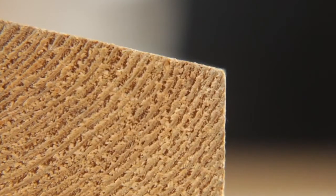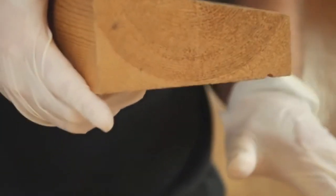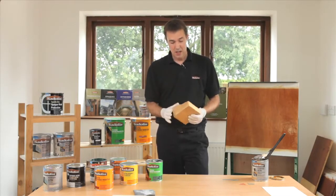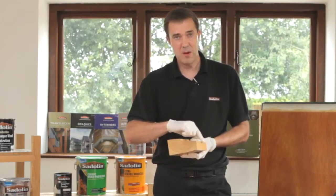There are a couple of other top tips, especially on the design side. Looking at a window ledge, we're trying to encourage water to run off the surface — flat window sills are not a good idea because we don't want water sitting on them. We also want to remove arises or sharp edges. You can see here that the surface runoff is at an appropriate angle, but the edge of this windowsill is too sharp — it should be three millimetre round, or pencil round. With all coatings, if you've got a sharp edge, no matter how hard you try, you will never get the same level of coating thickness on that edge, so it's not surprising that failure starts at that point.